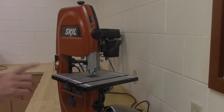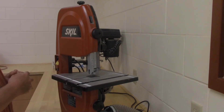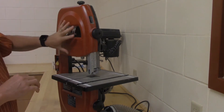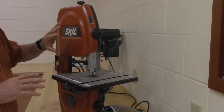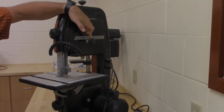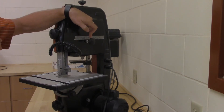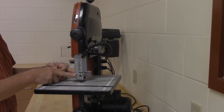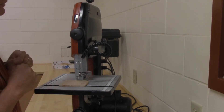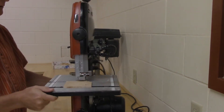A couple things to keep in mind when operating it. These band saws are not high quality machines — the blade comes off fairly easily, so be careful. Some things not to touch: up on the top there's a knob that adjusts the tension of the blade; it moves the wheel up and down. If you move that, the blade will become either too tight or too loose — it will break or fall off. Don't touch that knob. On the back there's another knob — do not touch that one either; it adjusts the tracking angle of the blade on the wheel. The guard mechanism you do want to adjust — you want it just above the piece of wood. If it's way up high, there's a lot of exposed blade and you can cut things off like fingers very easily. Loosen the knob, lower the guard down, and lock it in place just above the piece of wood.